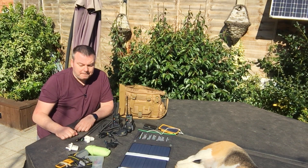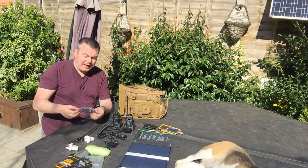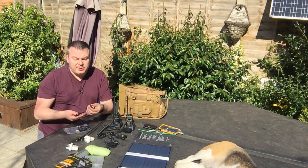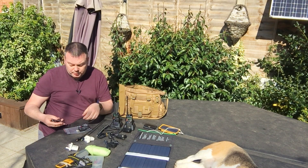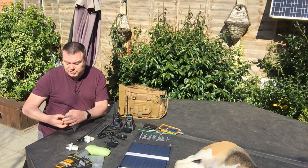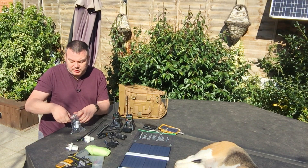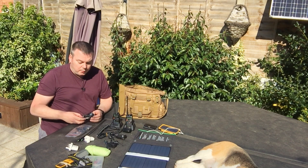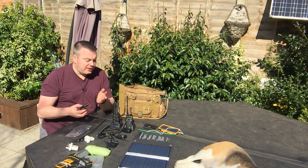For powering up, we have the desktop chargers and a couple of these neat little USB chargers. You plug them into a USB five-volt supply into the base and they give you the 12-volt output you need — there's step-up circuitry inside. The current is fairly low so it won't charge as fast as a genuine charger, but in cases where USB is more practical these will do nicely. We also have a multi-voltage cigarette lighter adapter charger for the car.